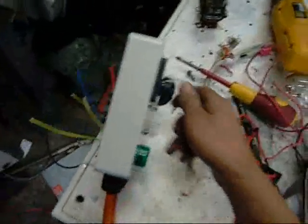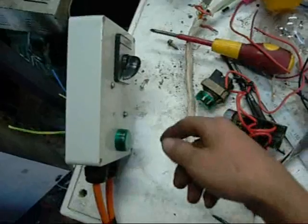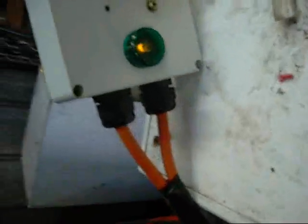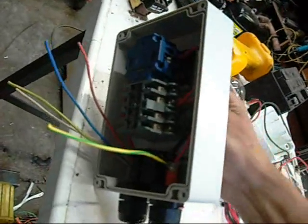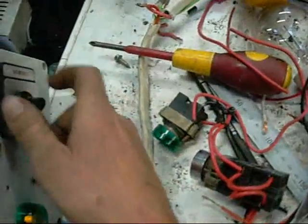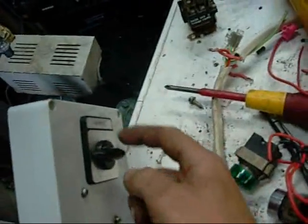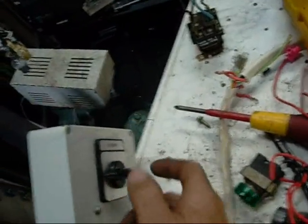I've got partial power on to it — I'll just demonstrate. So that would be normally fan and pump only run, and that's compressor run. The neon isn't exactly green but it tells me the power is on, and so does the contactor. The fourth position on this switch won't be used — it's designed for a voltmeter to read off then 1, 2, and 3 phases, so it's got 4 positions.